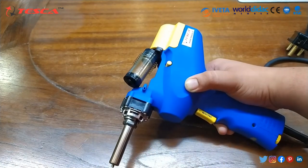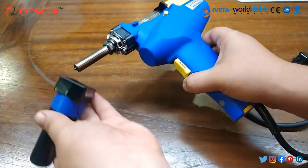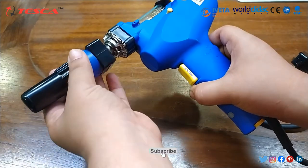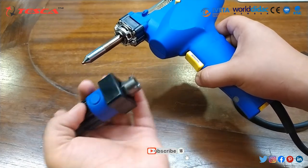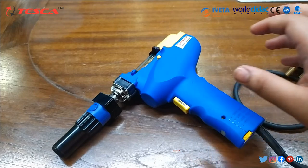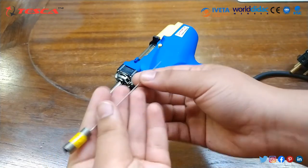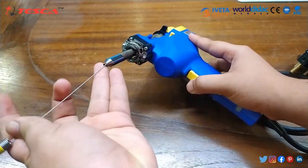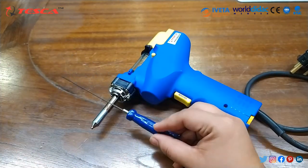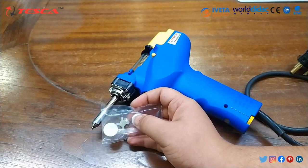This is our whole gun and this is the holder. Through this holder, we can remove the element because when the de-soldering gun is very hot, we are not able to remove it by hand — so through this holder we can remove it and clean it from the inside. This is the nozzle pipe; through this pipe we can also clean our heating nozzle from inside. Through this we can clean the heating core, and these are the two filters provided.